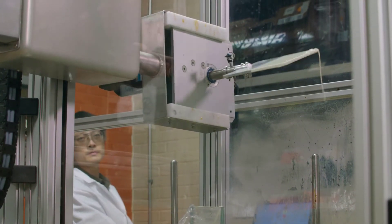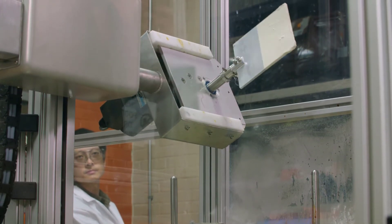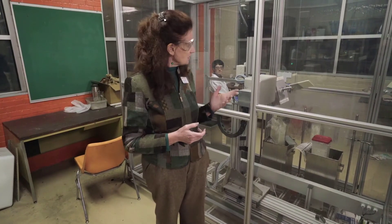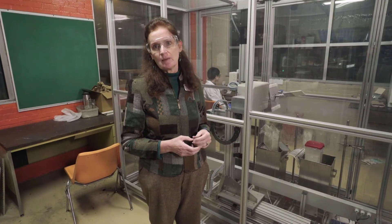We can use the same types of dumbbells that we use with solid rubber to make test pieces, and they also go onto the Instron. Now, this particular sample is a bit lumpy because while we were doing this, we actually had some coagulation in the tank. But normally we would filter that right at the beginning and these lumps wouldn't be there.